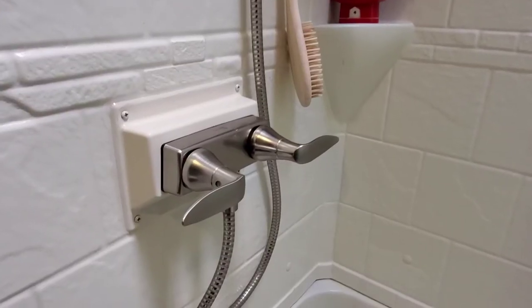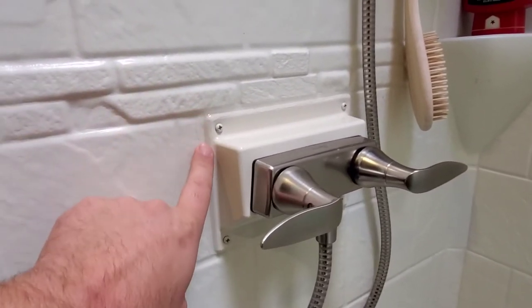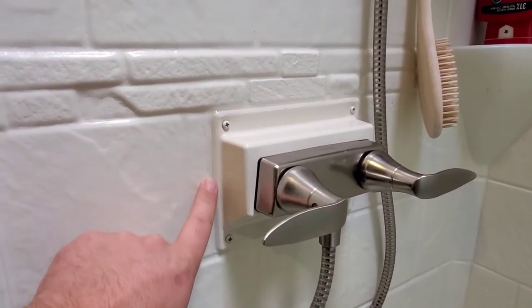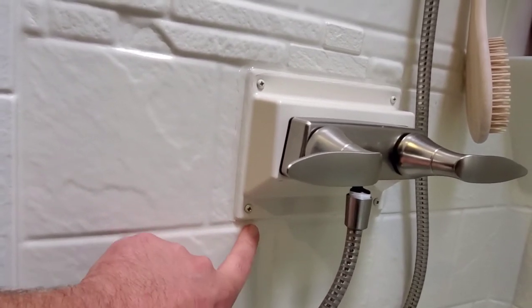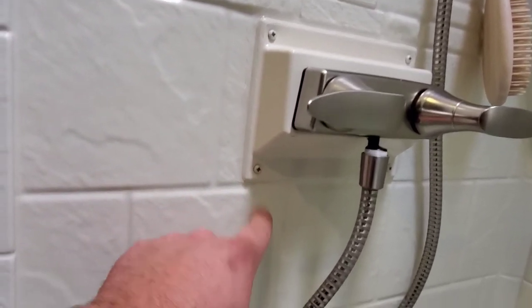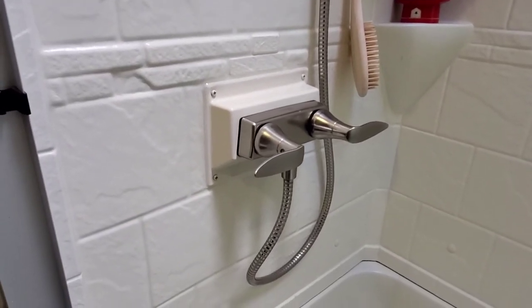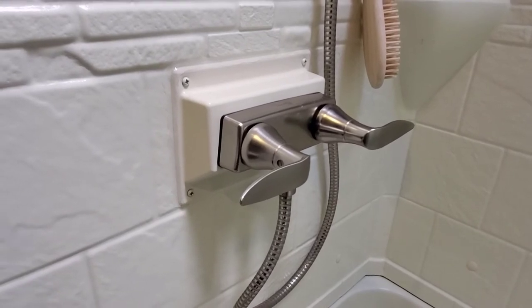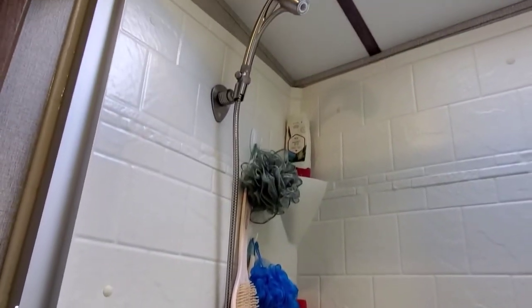I've already got my plumber's tape on my new faucet. I need to screw these lines to it, mount it, and seal it. There it is — fully installed. I've got my new silicone all the way around. Originally from the factory they did not put silicone on the bottom, so I left it open also. I believe that's so any moisture that could build behind it could be able to drain out. So there it is. Actually, I paused making this video and finishing it — we're at camp now so I have air conditioning.